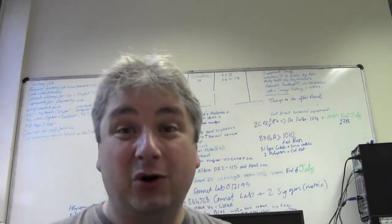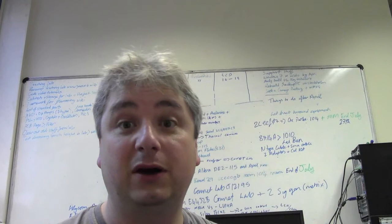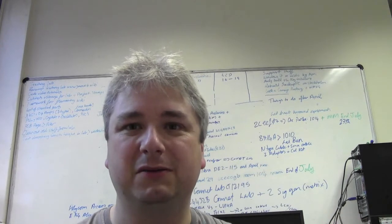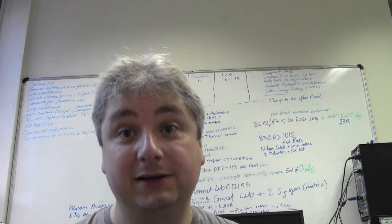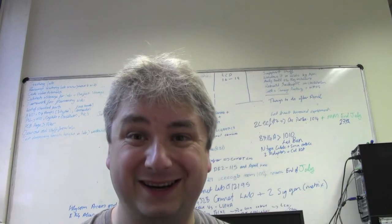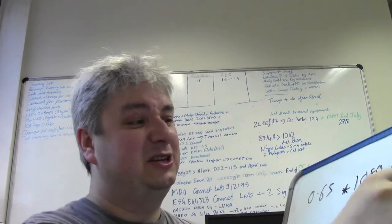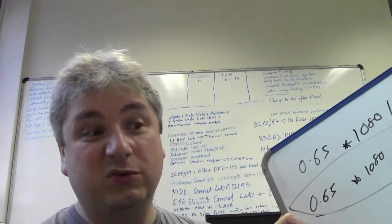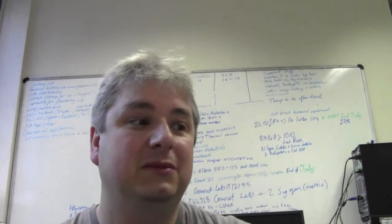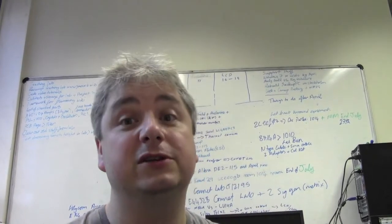It's not a particularly accurate one for time, like I said. It all depends on your activator, how well your solution is mixed, how much copper sulfate you've got in your electrolyte, how clean it is, how good your plates are. If your anode plates are breaking down and you haven't got much copper there, it's going to affect your plating time. This is just a basic rule to go by, but check it out, it can take longer, it can be quicker. It's a grey area, and plating is a very, very black art. If you do decide to do plating, it's a black art.